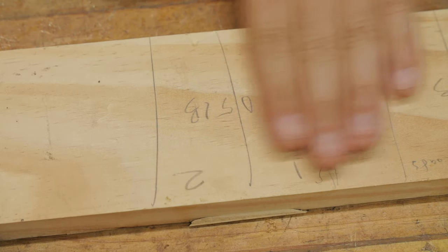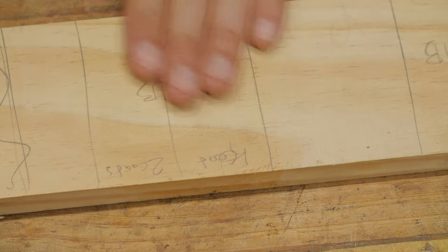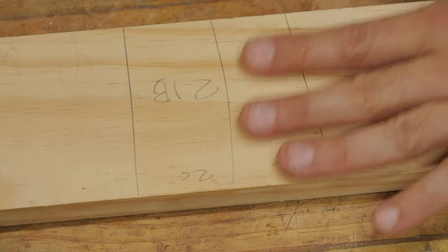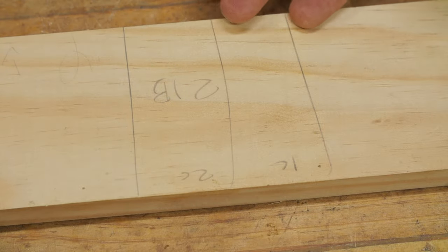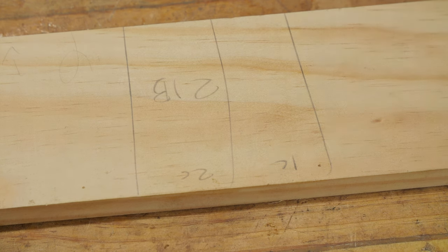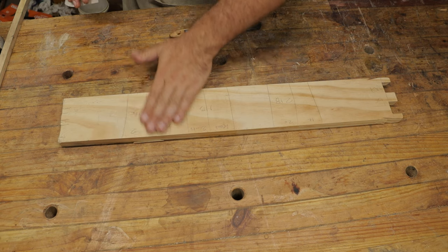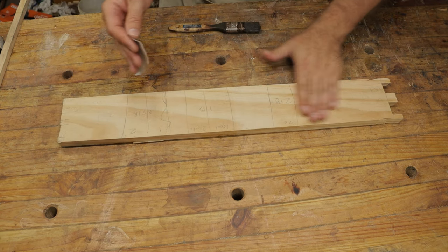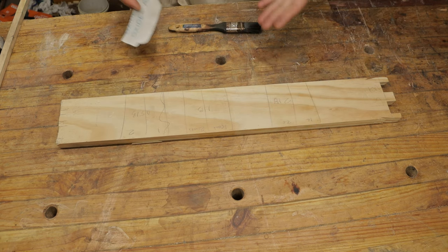You can see it's quite smooth to the touch with the shellac — it hasn't actually raised the grain, and that's the half pound. The one pound here is very similar, but you can see it's a little bit thicker in the coat — it actually feels a little bit thicker. And then we've got the two pound cut, which is once again a little bit thicker, although it's still quite difficult to see. The grain really hasn't raised. So now I'm going to go ahead, sand all these, and add that stain. Going with the grain — a very light sanding, especially with the half pound. That feels smooth, and there's a little bit of roughness over in the two pound. Now we're ready to apply the stain.